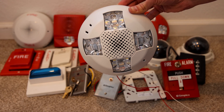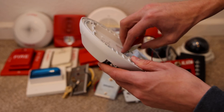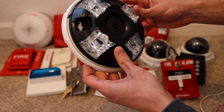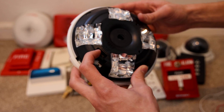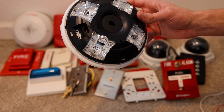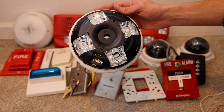This one's also kind of loud. It's really cool how all four of those flashers flash. Here's also another cool thing about these new alarms: if you take off the front, it is really easy to adjust the candela settings and go all the way up to 115. And then in order to change the tones, all you have to do is flip the switch right here — it's not a dip switch, it's not jumpers. It's just a simple switch that you can flip as many times as you want. You can do continuous or temporal on low or high volume.